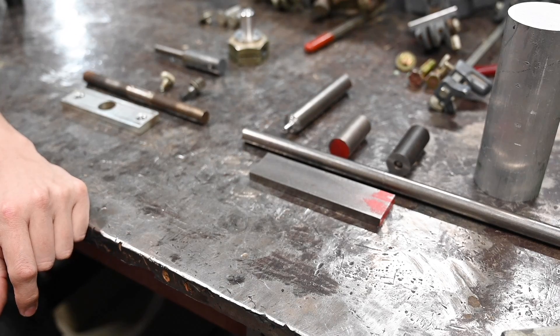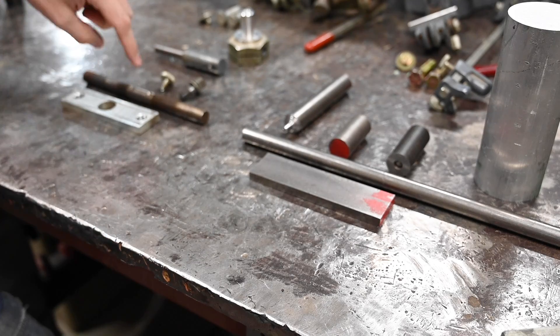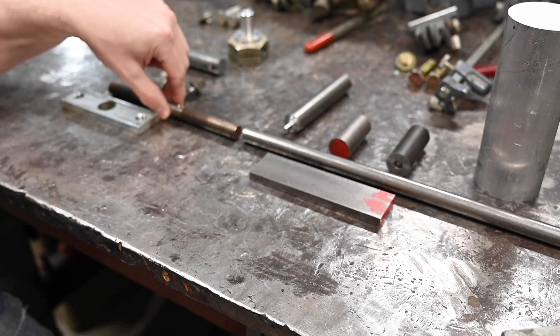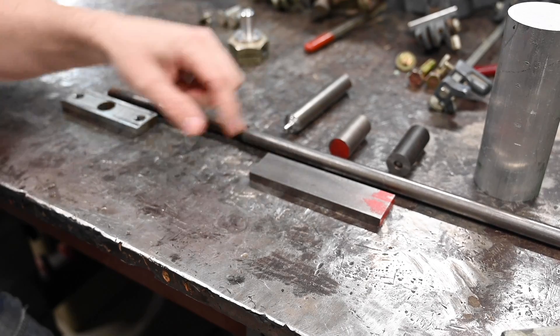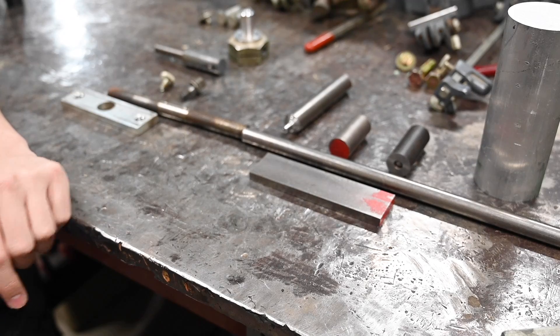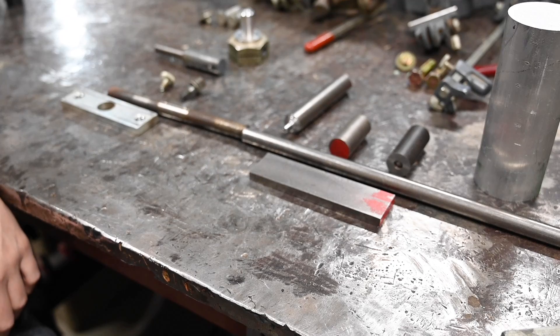Here's the raw material. In this video we're going to focus on the lathe work, so let's turn the Monarch on and start making some chips. We'll go easiest first — cut this down. It's a little bit undersized at five-eighths, so we've got some five-eighths material, we'll turn it, and then we'll put some dimples in there for the set screws. Should be pretty simple.